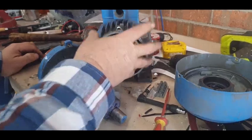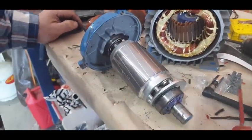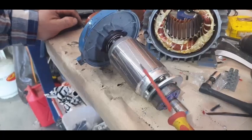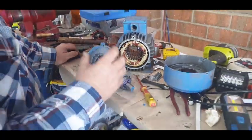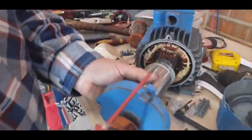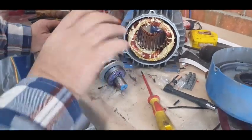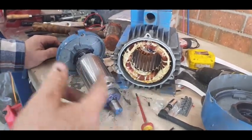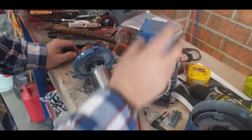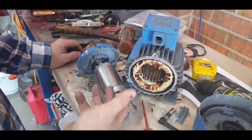This rotating magnetic field on the stator is like the primary on a transformer. Once we charge it up, the rotor becomes polarized — those little bars get a magnetic field around them. The magnetic field cutting between the two magnetic fields creates a push-and-pull effect, so it becomes rotating without actually touching. There's a one-mil air gap — so the magnetic field has to cross that air gap to get into these bars. This is the secondary, this is the primary. But instead of getting a voltage and current output, we actually get torque or momentum. So we're converting electrons in a winding to mechanical energy — that's the definition of power: you can convert it to heat, light, or mechanical power.